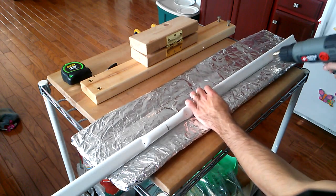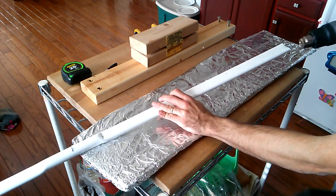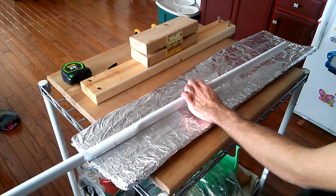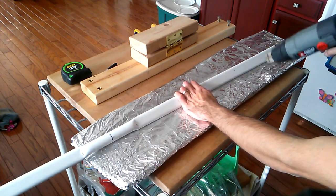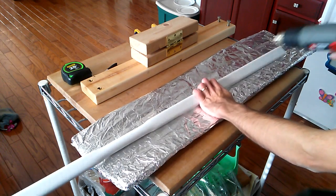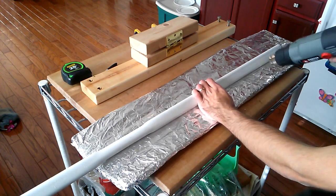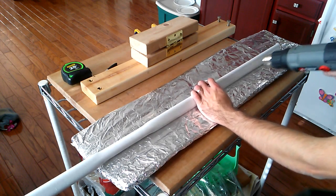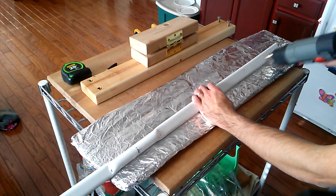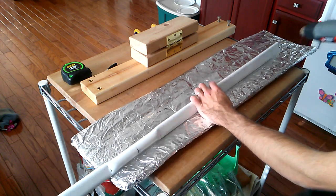So, curlicues all the way down on both sides. Taking your time. Now, once you notice the ends start to puff, you can speed that up by carefully just teasing it with a little bit of heat, and even just tease the edges with heat, but don't focus on them. If you do, like I said, you're risking burning and splitting the ends. With this particular bow, splitting the ends is probably not going to be that big of a deal, since they're more likely than not going to be cut away. Nevertheless, I will advise caution. You're better off just taking your time.